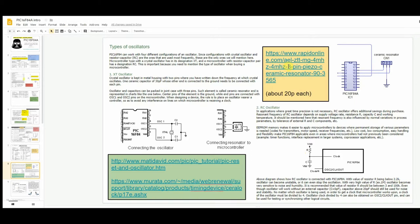Don't choose an RC oscillator just to save money — we only pay about 20p for ceramic resonators anyway. If you're using Circuit Wizard, which has a limited component library, just use a three-pin single inline connector in place of the ceramic resonator. If you don't have a ceramic resonator or crystal and want to use a resistor and capacitor instead, there's a table coming up showing how to calculate the frequency it will give you.